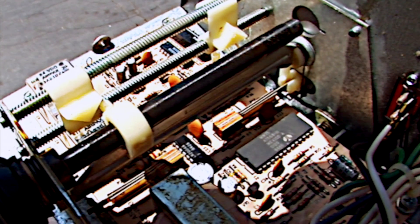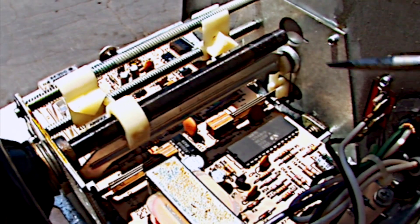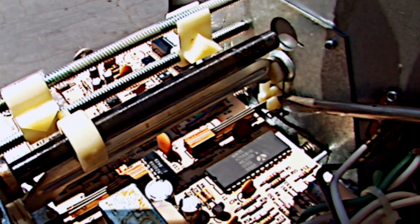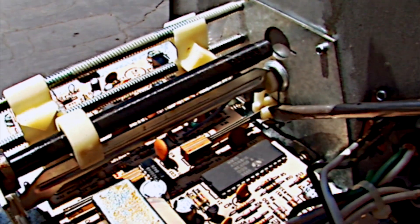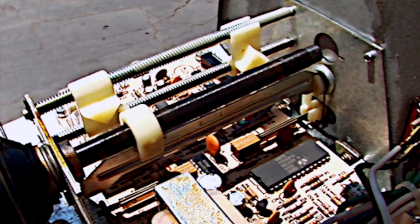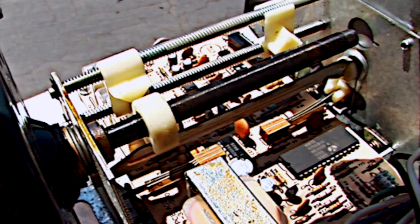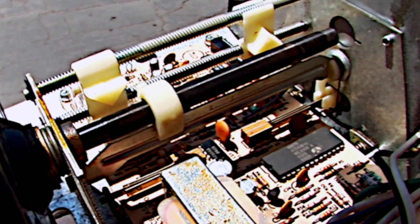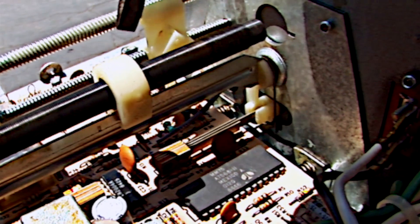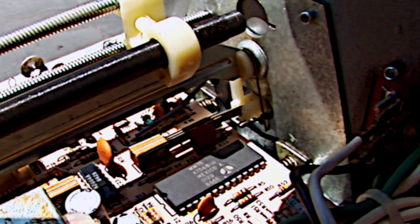On the up and down limits, there's another micro switch right here, and you've got a little yoke that swings back and forth, swivels this plate, and makes a contact. You can see how that's moving. I'm going to activate it and you'll see it work. It shuts off, hit it again, comes off and does it again in the other direction. You can see that little white nut traveling — it's going to hit this little V and shut it off.